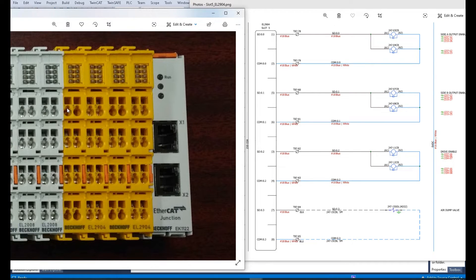That is the actual picture of the safety output module. We can see each safety module takes two slots. According to the wiring diagram we just showed, we will only use the right side slot. Terminals one and two are the first channel, five and six the second channel, three and four the third channel, and seven and eight the fourth channel.